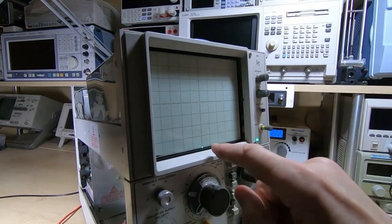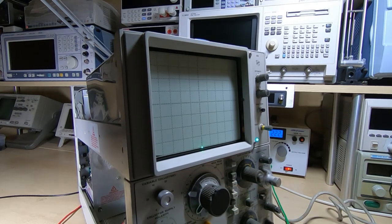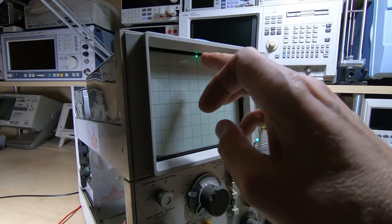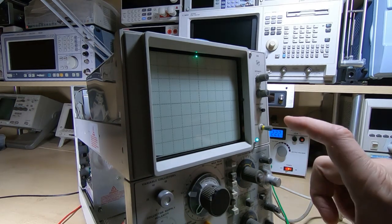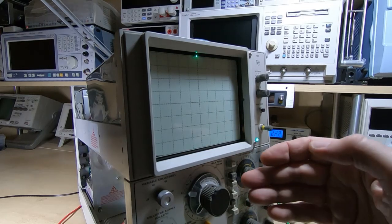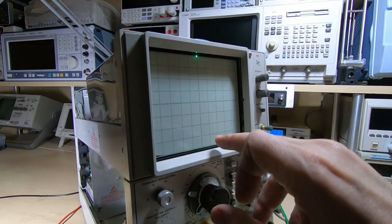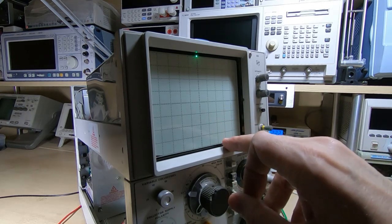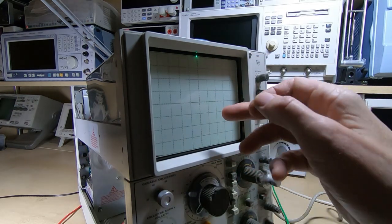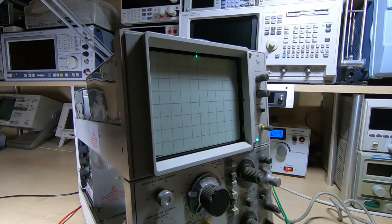We've got the dot on the very bottom graticule of the display. I'll select the device and we'll see it jump up to the top line. The voltage on the test point is exactly four volts as set with the offset multiplier, and we can see that the dot is now exactly on the top line. This sets the overall gain of the vertical amplifier and will ensure that irrespective of what offset or gain we select, it will display correctly on screen. If you recall from the previous video, it wasn't quite correct — when I selected one milliamp per division, for example, we weren't getting exactly one graticule per step when displaying a family of curves. Hopefully that's now corrected.